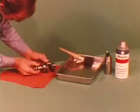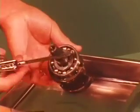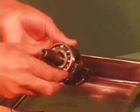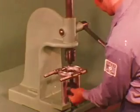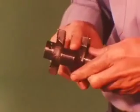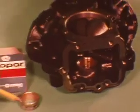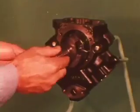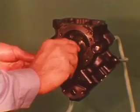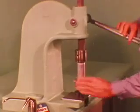With the main housing stripped, remove the gas seal and discard it. Wash the front bearing in clean mineral spirits, re-oil it, then check for roughness or flat spots. If you detect such a condition, press the bearing off. Before installing a new bearing, make sure there are no signs of scoring on the rod journals, or bushing metal wiped over the rear journal. Also check to see if the bushing has turned in its bore. If you find it turned or scored, do not attempt to replace it unless your shop is equipped to handle precision rebore and honing. If the crankshaft journals and bushing appear okay, slide the shaft into the bushing — a slight amount of clearance is considered normal.